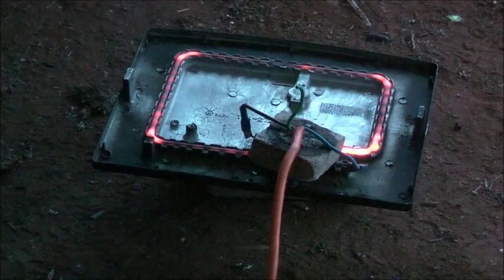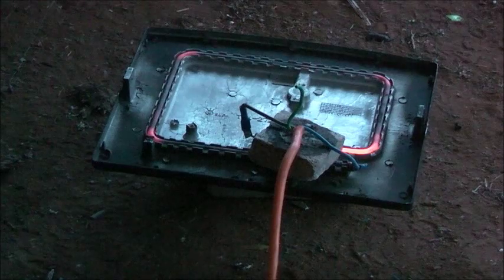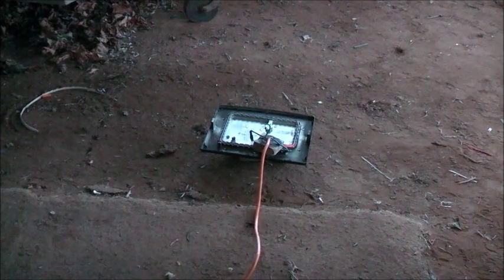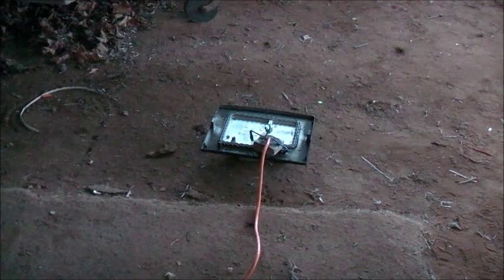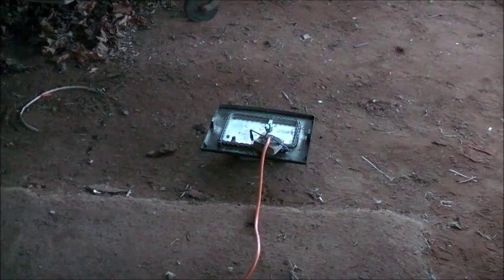Power off. That's enough for now. I need stronger wiring. The little extension cord here going off on the side of the caravan is starting to get warped, so time to shut down. Don't let it get any warmer than that — that's only a 10 amp cord. I'm going to have to upgrade that wire to burn this thing out. Everything's unplugged. I'll just check everything behind is okay. Yep, everything behind is okay.